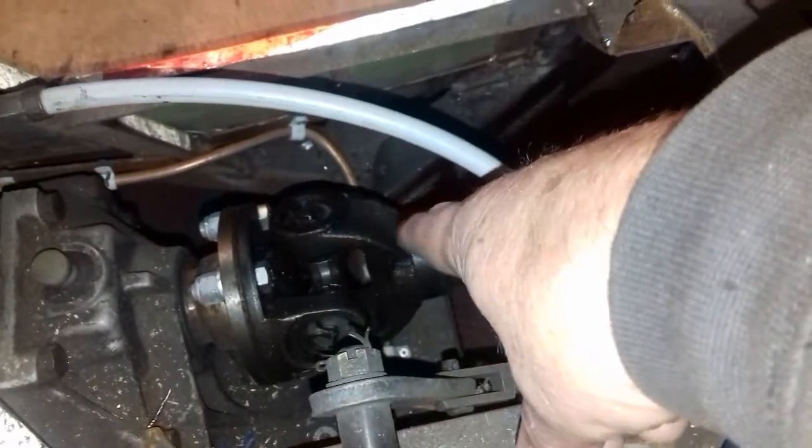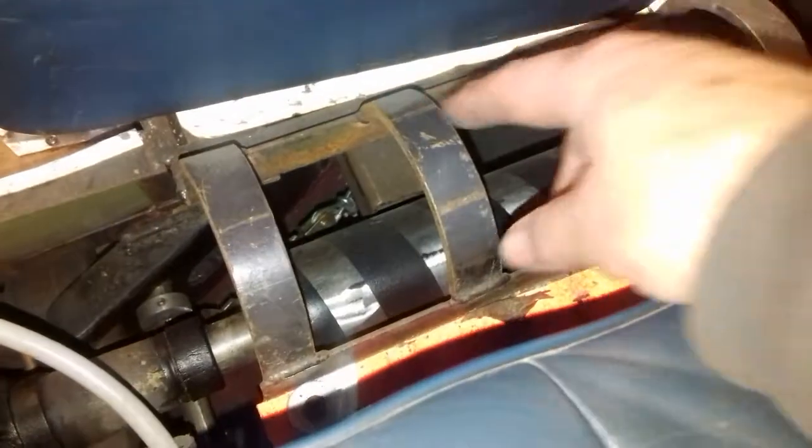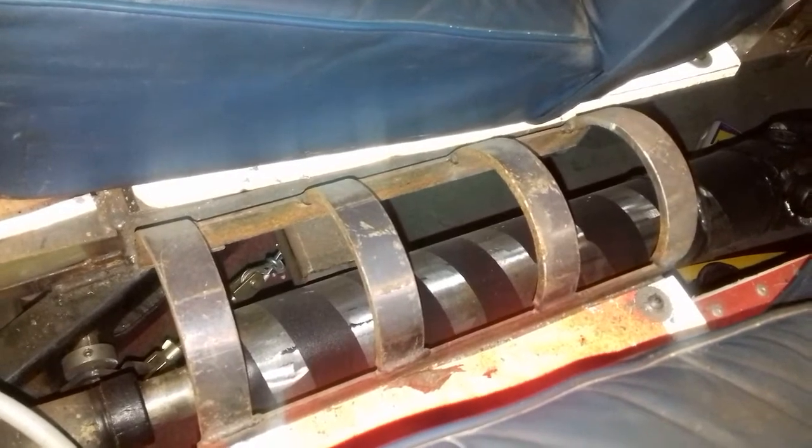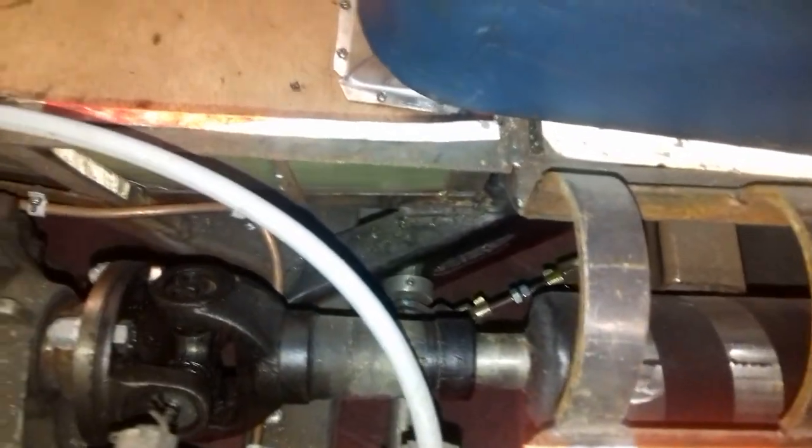And then we go down here, we've got the drive shaft. You can see it here — the drive shaft goes through there, right back to the back axle. I can't remember which one — I've done all of the UJs — but that yoke there was from the taxi, which is all brand new. And I managed to get another yoke — I actually had to buy this one — to make it fit to the Jaguar ZF gearbox. That's all done, all shortened. I painted it with a little stripe on it. I'll probably leave this all uncovered — it would be quite good seeing the prop shaft spinning around at 100 miles an hour.